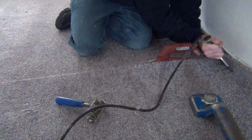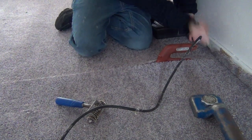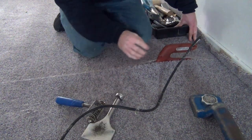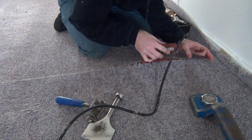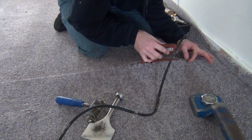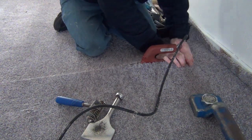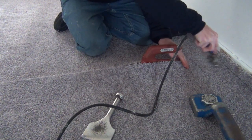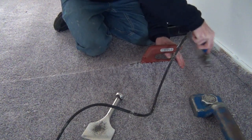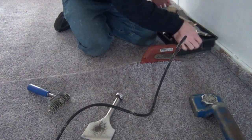And I stair tool it down into the corner. And I'll move my iron about 6 inches away from the wall. Make sure your backing's all tight. Take your tractor. Move your nap rows to where everything is hidden.